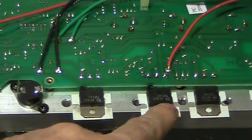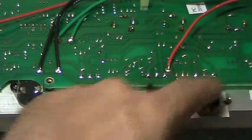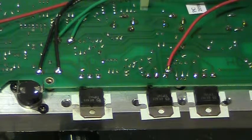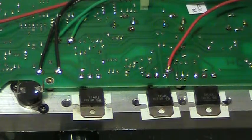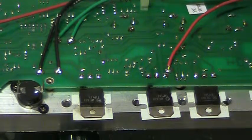These transistors are not cracked — gas had just expired from them. The only thing I can think of that would have caused this is if he hooked the channel up to a dead short or something of extremely low impedance. When he turned the amp on, because it's solid state, it just exceeded the dissipation rating on these two transistors. And he had to do it twice — not only did it not go on the first attempt, he had to blow another fuse to kill the transistors.